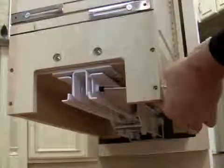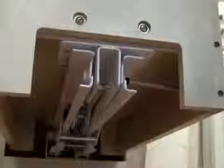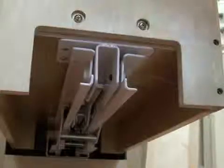Next we're going to grab our supplied Allen wrench and our 2 black set screws. Now you'll notice on either side of the pantry there are 2 access holes. That's where you will insert those and tighten into place. These set screws are also micro adjusters that will allow you to center the slide either left or right depending on how you tighten or loosen them.